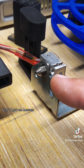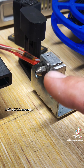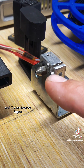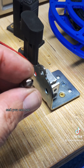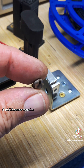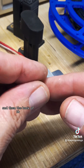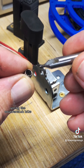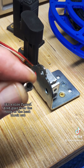The nozzle itself has been specially prepared. I used 1.7mm drill bits from Amazon to drill it out, and to get closer to 1.75mm you can wobble the bit just a little while drilling. I also had to taper the back of the nozzle to be part of that same funnel made in the heat block. This nozzle started off as a standard 0.4mm nozzle for a 3D printer; I drilled it out to 1.7mm and then tapered the back using the countersink bits, creating a nice funnel from the back of the heat block through to the front of the nozzle.